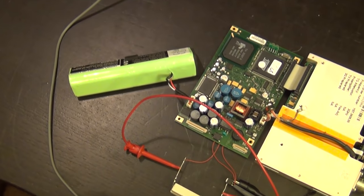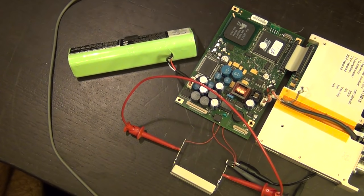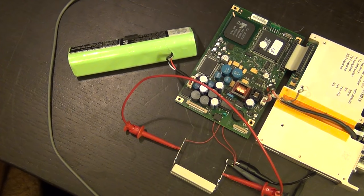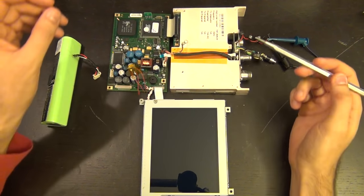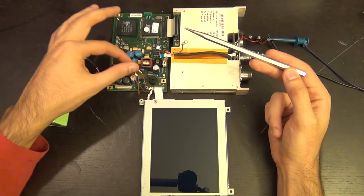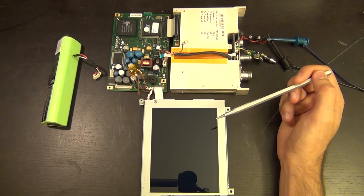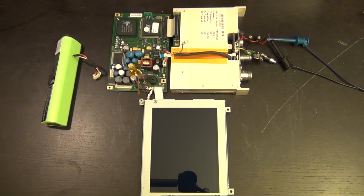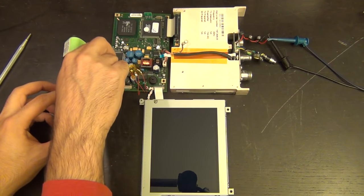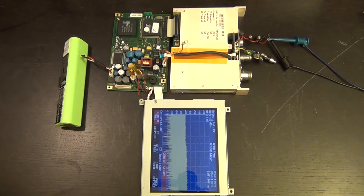This is a very good sign. It means I should be able to completely remove the resistor, solder the wires directly to the higher-current MOSFET, and then try to turn it on and see if it powers back up. Here's the transistor, wrapped in tape so it doesn't accidentally touch any other components. I connected the screen. Plugging in the battery... no smoke... and it powered on! It powered on by itself! I'm not sure why, but it did. Fantastic - it actually came back to life!